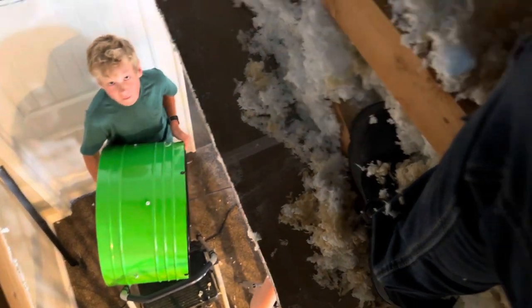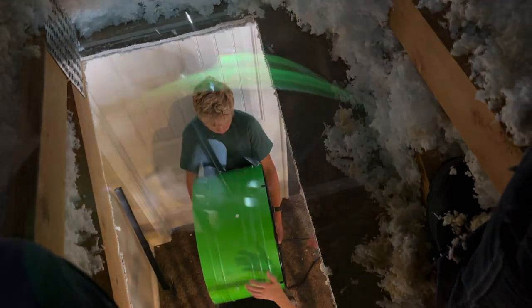I found a spot between my joists here — this is my cardboard template. I'm just cutting out the drywall. I have to do mine on the slope of my roof because the joists aren't wide enough in the other direction. I'll cut this out and start getting the equipment up here. I got the baffle box brought through, and then fit the fan up through here. Now that I have the fan up here, I'm just getting it installed — a couple of screws into the rafters. It's going to be blowing all the way down that cavity, which is the highest part in the house. The tube is just going to connect to the hole and then snake up and hook onto the back of the fan.